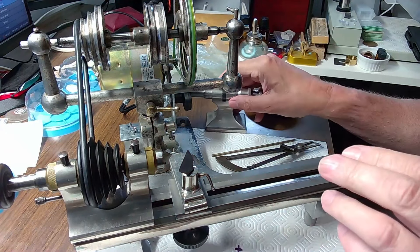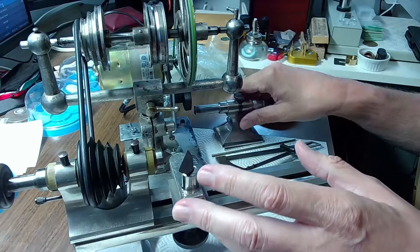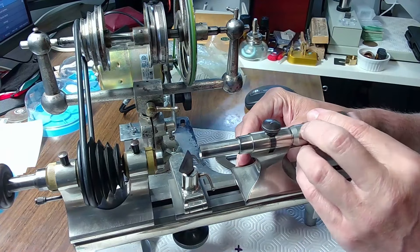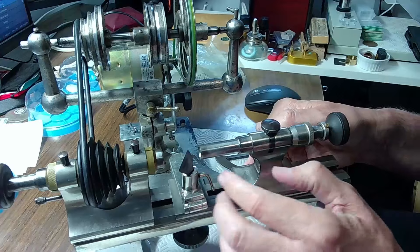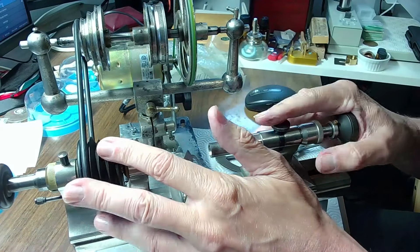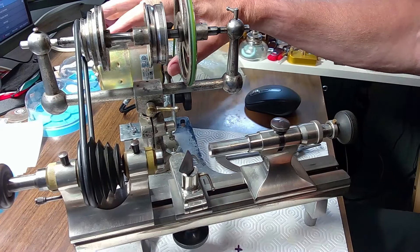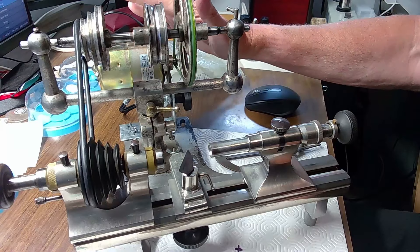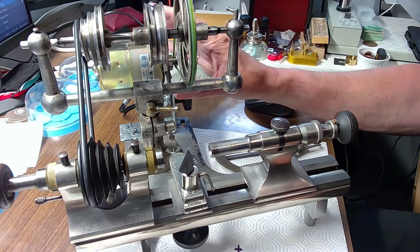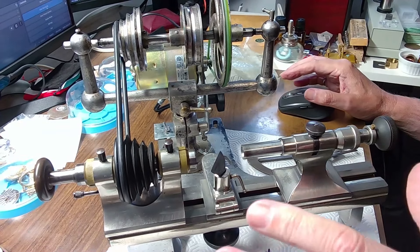So that's my video for today. Good luck — make sure you get a lathe that's from one company. This is Boley. Don't try to buy a WW lathe bed and try to match it with two different types of headstocks and tailstocks — you're going to get in trouble. Find a lathe that's from the same family — they're twins, basically. If you can find a counter shaft, you're good. If you can't find a counter shaft, get yourself a bigger motor. I found that these little sewing machine motors are extremely reliable, work really well, and are easy to jig up on your lathe.